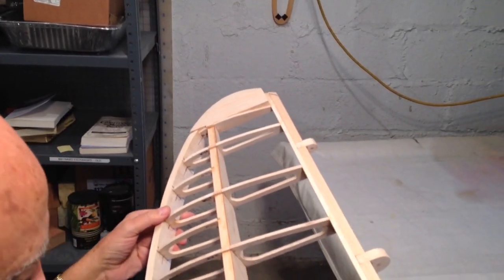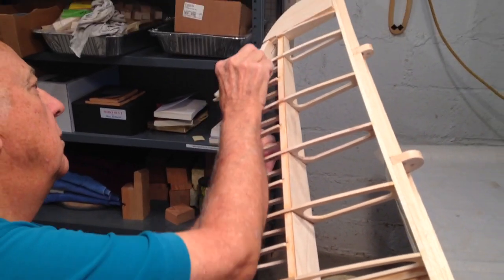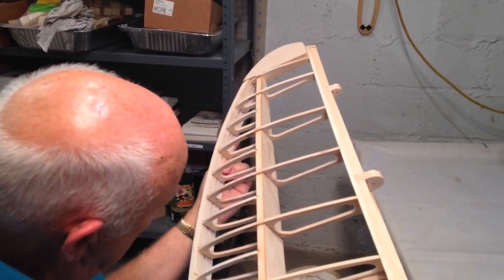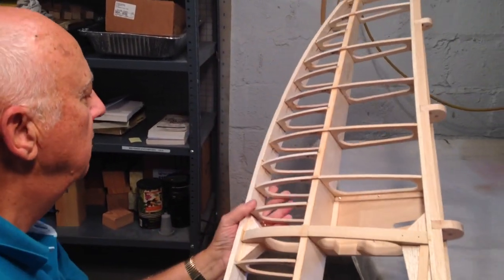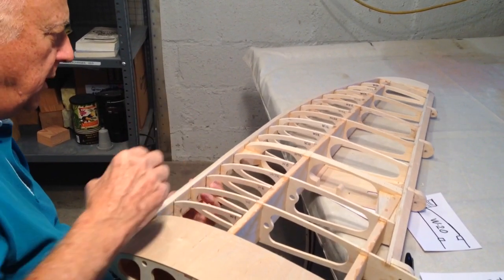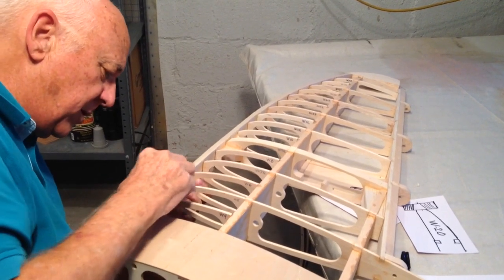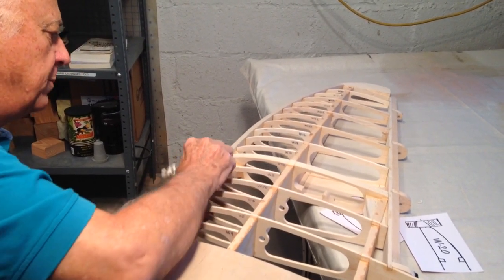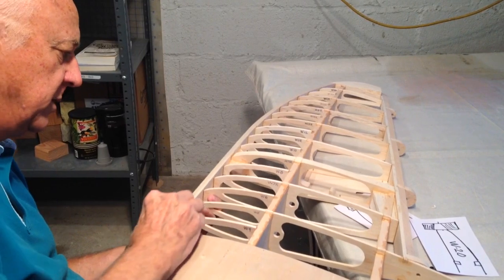I don't know exactly how much this takes off in one swipe, but I imagine around 1/5000th of an inch, so you don't have to do too much. I'm planing down where it's sticking out the most. You want to plane all over — don't just stay in one place trying to get it perfect, then move up and try to get it perfect there. That'll drive you nuts. It's much better to go slow, with a lot of patience, and shape the whole thing as if you're going to bring it all down at once.